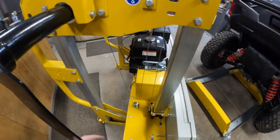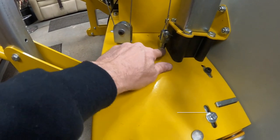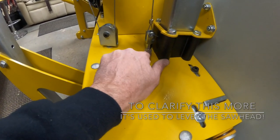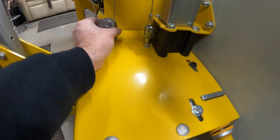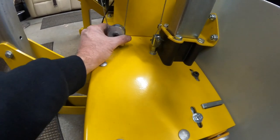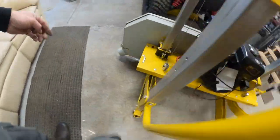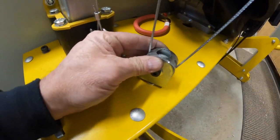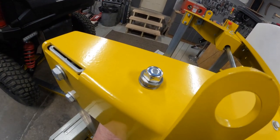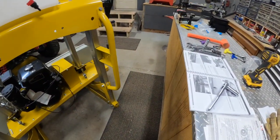I went ahead and lifted it just to make sure — I cranked it and it lifts. I had a little bit of tension, so I tightened this nut down — hold it underneath with a 17, then a 16 right here — just tighten this down so it doesn't wiggle. I did it with this one, that one over there, and then this one. You can see they don't move very much — that's the goal. They'll twist a little bit but there's no jiggle to them.